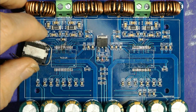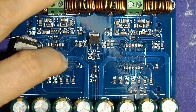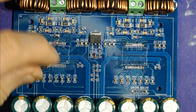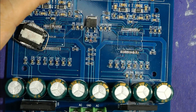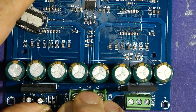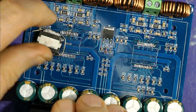So they've actually rated it wrong — it's more like a 600-watt RMS amplifier: 2 × 300 watts. At full supply voltage in bridge mode at ±33 volts, you're getting 150 watts per side, so 300 + 300 = 600 watts potentially. But there are lots of reasons why it won't reach that. After you've put in a decent transformer — a 600-watt 24-0-24 transformer will probably cost you £70–100 — it's probably better to try and salvage one from an old amplifier.